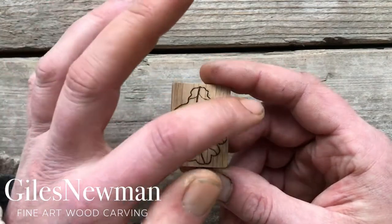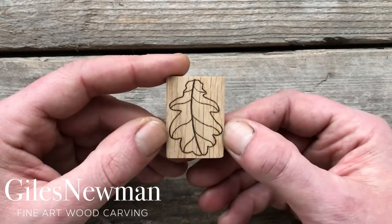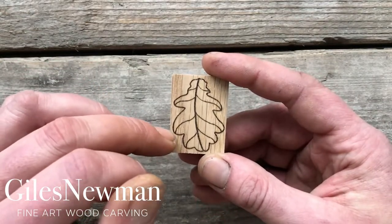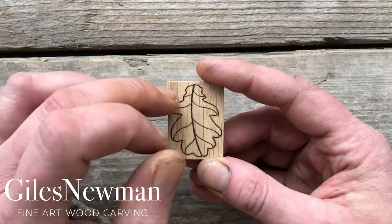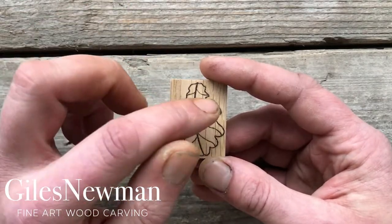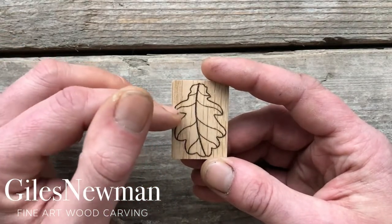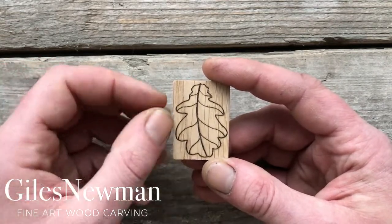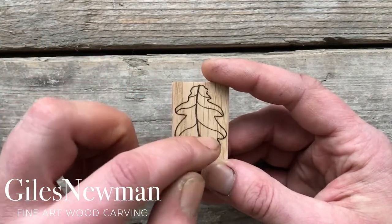Start by shaving down the sides, bringing the outer edges of the wood into the outermost areas - these two lobes on either side. Once you've done that you can start using the knife from just below those points to remove the waste wood from outside of the lines, and do the same here but going up from that point. Once you've done that you can then start to look to cut in between the lobes. To do that, make a fairly straight cut in following that line and then take a slice up to that line to remove just a little wedge of material each time. Repeat that process until you get into all of the nooks and crannies all the way around.